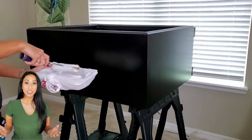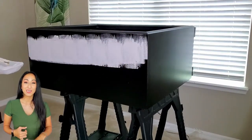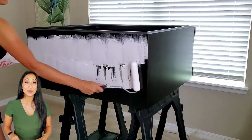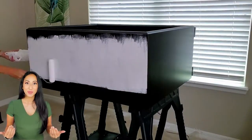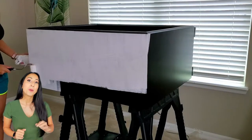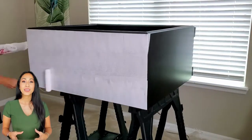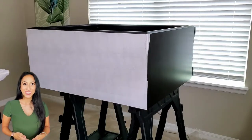When you're painting a dresser without sanding, you definitely want to make sure you wipe it all down. But a key ingredient is also the primer — not just because of the major color difference I'm doing with this dresser, but primer actually helps adhesion between your paint and the actual dresser unit.